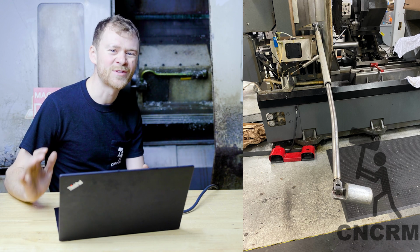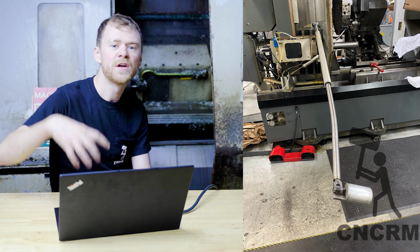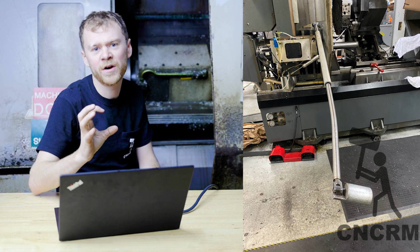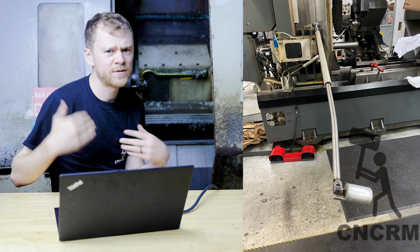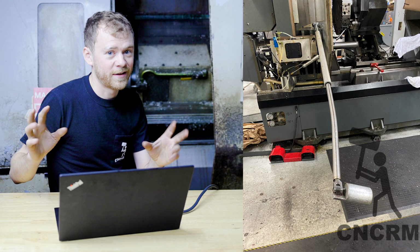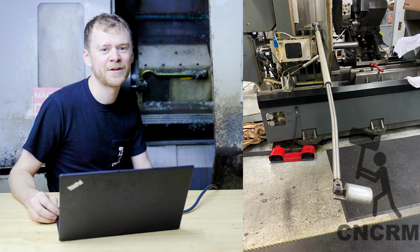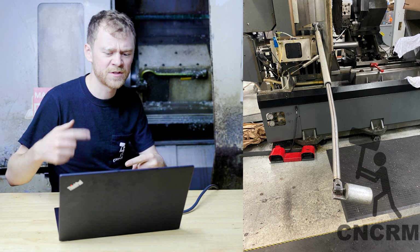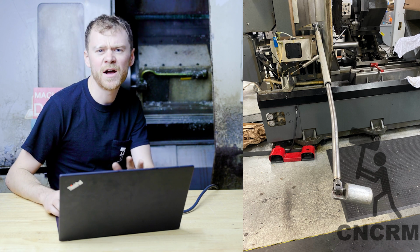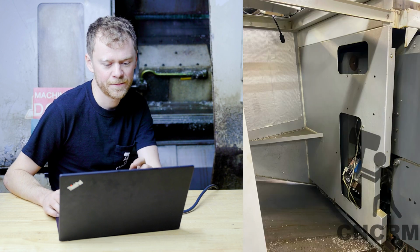The good news is it's a Y-axis machine, so I can shift the grid shift and the home position for the Y-axis, which essentially turns the turret onto the center, and then I can move X. So I quickly dialed in the spindle, quick in a sense, but I got the spindle somewhat straight so that then I could check concentricity. I ended up having to tweak the spindle and the sub at the end, but in the process, before I took the turret off, I moved the spindle to be straight.